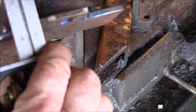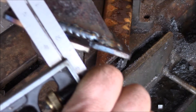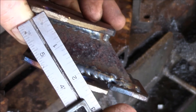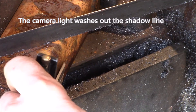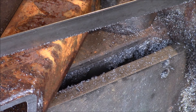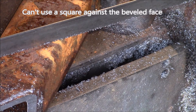This one's supposed to be two and a half inches and you can see it only measures one and three quarter, but the key is you have to measure it at that angle between the bolts — and there you can see we've got two and a half from top to bottom. You can just barely see the shadow line of the saw blade, and I can use that to set the height. I put a mark on the tube and slide it in until the shadow line falls over the mark, so I know I have my length — because measuring from this edge over to where the next cut will be is really hard to do directly.